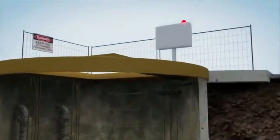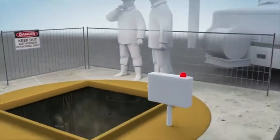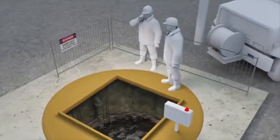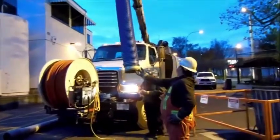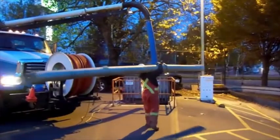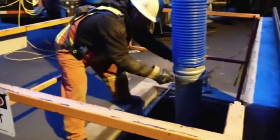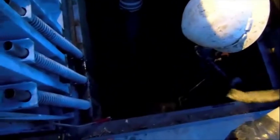To avoid failure, all these items need to be regularly maintained. Regular maintenance would require you to clean out the lift station. This is not only a threat to worker safety, but requires the lift station to be shut down during the pumping and cleaning process. The effluent is pumped from the lift station into a pumper truck, and then a pressure wash gets rid of harmful chemicals to protect the pipes from corrosion and buildup.